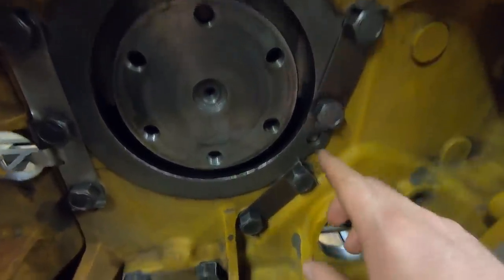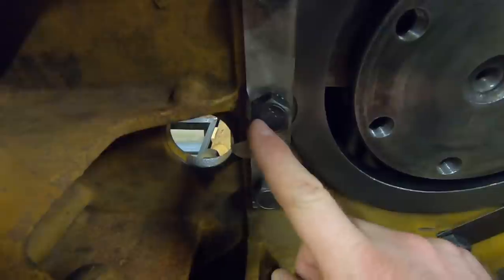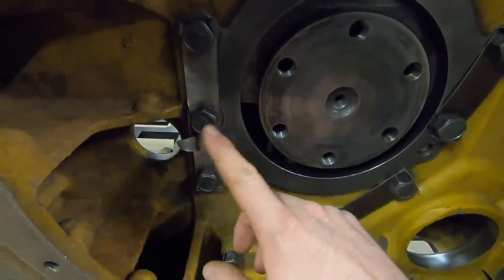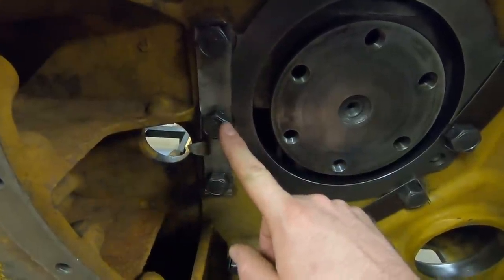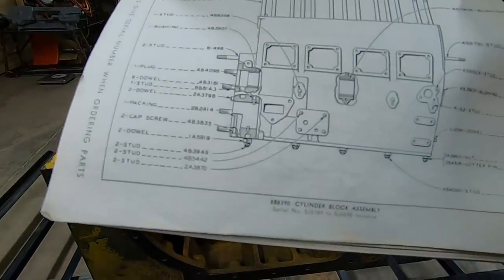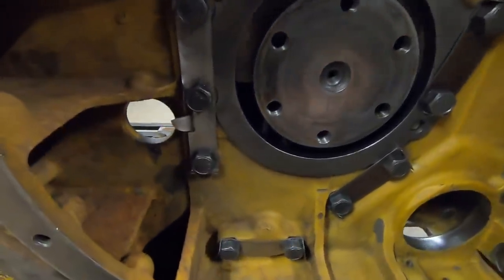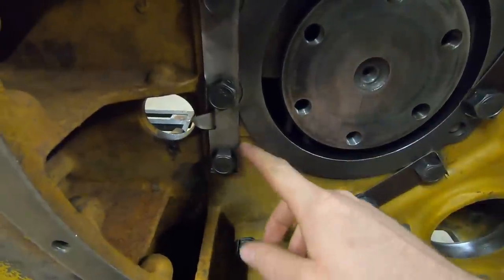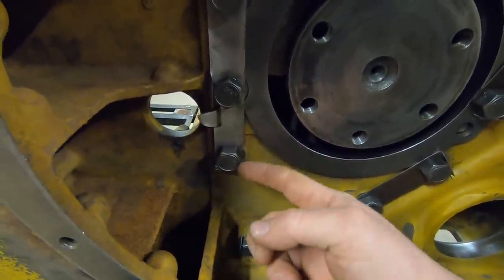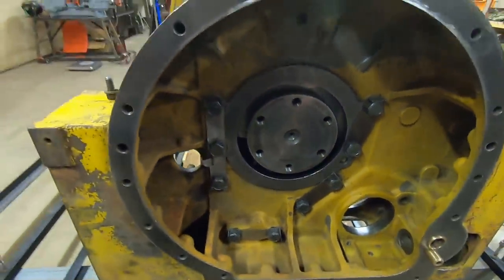All the bolts are tightened in well and I got all the lock tabs folded right over. I'm pretty happy with it - didn't distort my pointer at all, and got that side tab folded up just nice. One thing I forgot to mention earlier: about midway through J-series production they abandoned the bolts in the bell housing and went to studs with nuts, starting at serial number 5J5789. The reason is that every time you run a bolt out of a threaded hole and back in you degrade the thread quality, whereas a stud rarely has to be pulled from the block - you're just wearing out the stud, not the block.